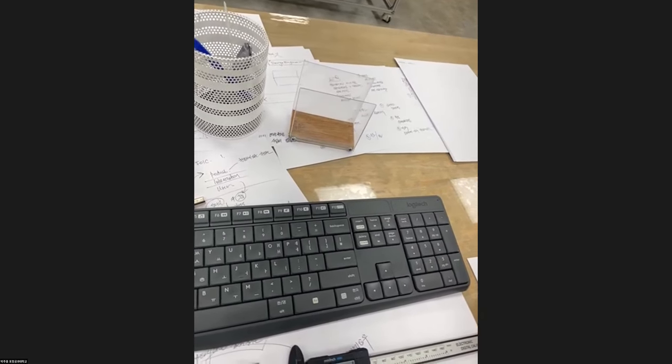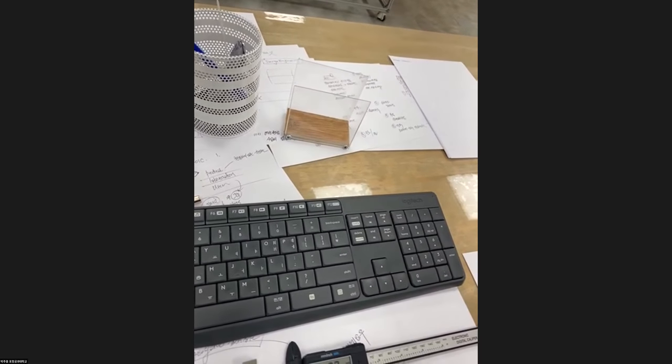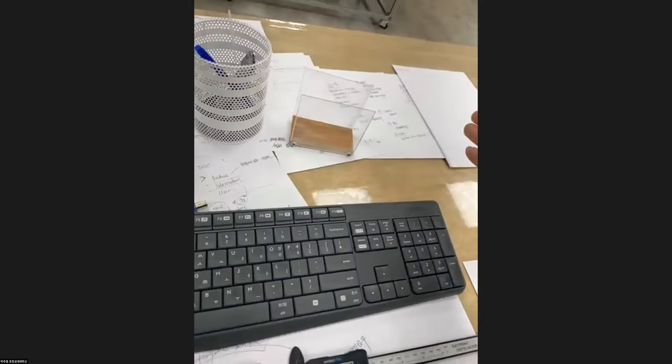Particularly, what do you have to change here? You have to change all the openings and all the joints that you assumed for 2mm thickness material. If the only material left is 3mm, then you have to change the whole design, meaning you have to go through all these processes from scratch.